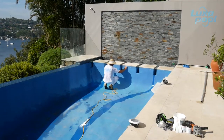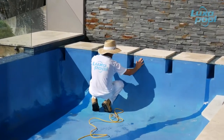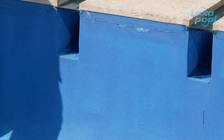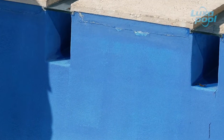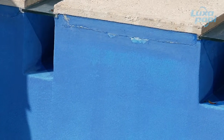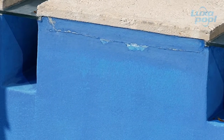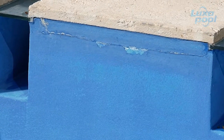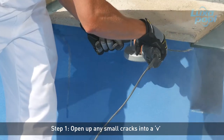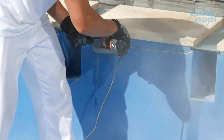Inspect the surface of the pool for cracks and divots. A small divot has a depth of less than 10mm and a small crack has a width of less than 5mm wide. Divots deeper than 10mm needing repair should be filled with a sand and cement mix. If your pool is rendered or plastered, or if you own a marble sheen pool, check first for drumminess. If you do have drumminess or large cracks, contact Colormaker Industries for further advice. Small cracks need to be opened up into a V shape to the base of the crack using an angle grinder with a masonry cutting disc.